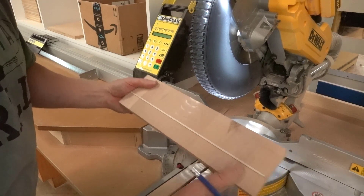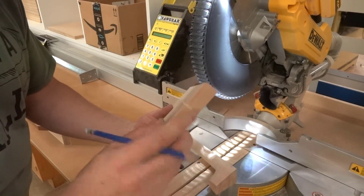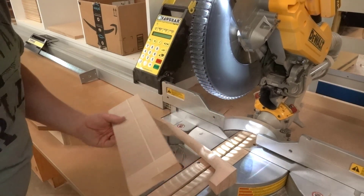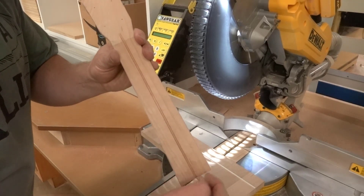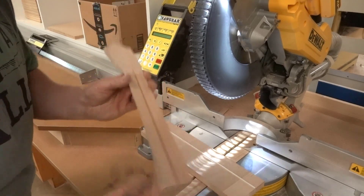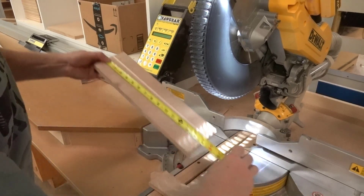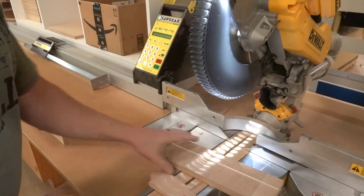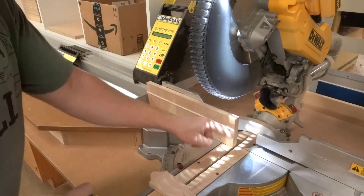In the cart with the templates is this simple little jig — just a flat piece of wood with a piece of eighth-inch material sticking out. You remember before we cut this notch into the top. Now it may not be exactly centered, but it is straight — exactly straight where we need it. This board is exactly 15 inches, so I set the saw to 15, so the edge of the blade will cut on the edge of this board.